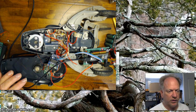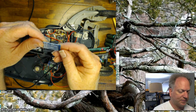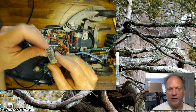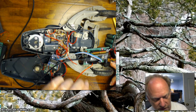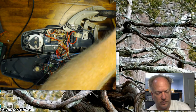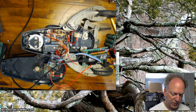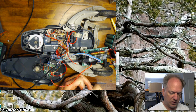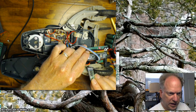But let's go ahead now and hook up a Bluetooth. I'm going to use one of these HC05 or 06 devices. They're really super easy to use. There's just 4 pins. 2 of them are power and 2 of them are for transmit and receive. And the way that I've designed this new motherboard, including the smaller ones for the 3.2, is there's a bus right here, which makes it super easy to plug in one of these modules. All you have to do is line up the voltage and ground with the voltage and ground here, and it slots in literally at the edge of this board.